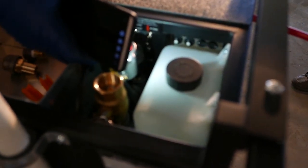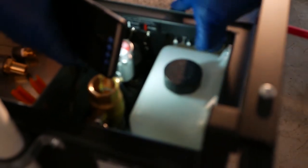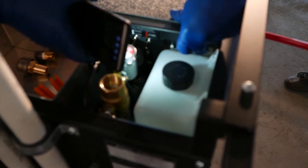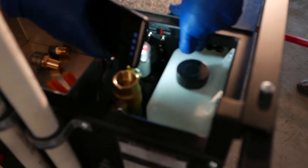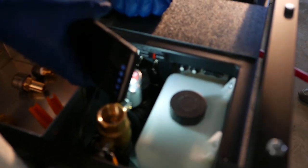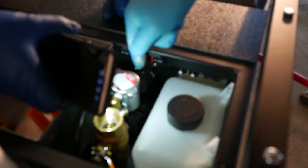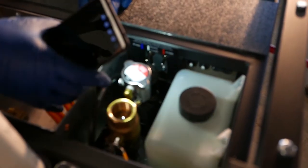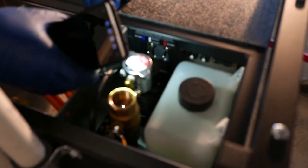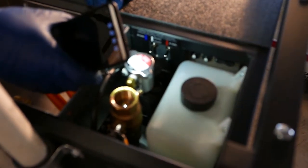On the MPF-C30, the heater breaker is 20 amps; on the MPF-20 that becomes a 10-amp push-button reset in the same location, regardless of model. There are also motor reversing switches — pump reversing switches — which are becoming standard on all machines.